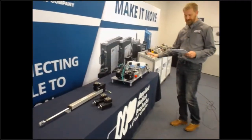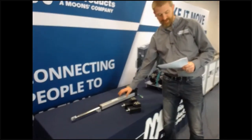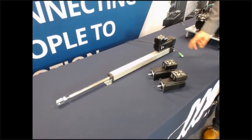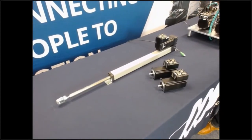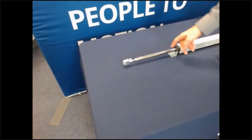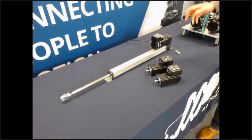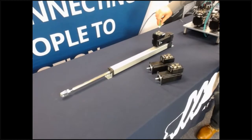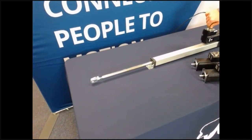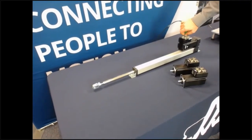Now I have my favorite demo over here, but I'm saving that one for last — I want to talk about the basics first. A really common entry point for integrated motors is as a pneumatic cylinder replacement. Generally these have an extended position and a retracted position, and instead of a motor they just have a port for pneumatic fluid. What I have here is a rod-style actuator designed to be a pneumatic cylinder replacement. Because we have this step-servo motor attached to it, we now have access to an infinite number of positions along this actuator, not just extended and retracted. And because this particular step-servo has the TrueCount encoder inside of it, we're able to plug the thing in and have it start moving between predefined positions almost immediately — notice there's no homing routine, it just starts moving. And when I unplug it and plug it back in again, it starts its positioning moves right away. No need to home.